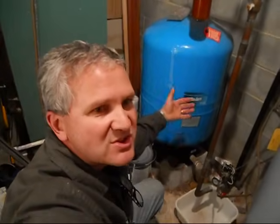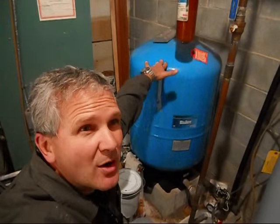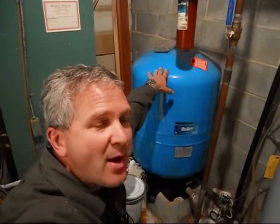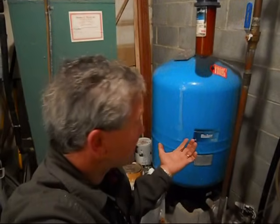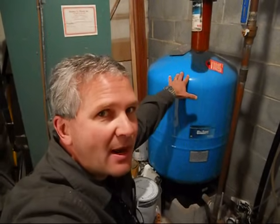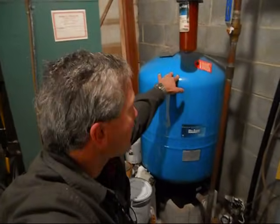So if this was going on at 30 PSI, you'd set this at 28 PSI. If this lowers over the years, then the pump's going to come on all the time. This provides a constant pressure on the system when the pump is not operating. Otherwise, if the pump pressure went off like it did with us in the shower, you have no water pressure. So if over the years this drops off, then the pump keeps running and fails — and I think that's probably what happened to us.